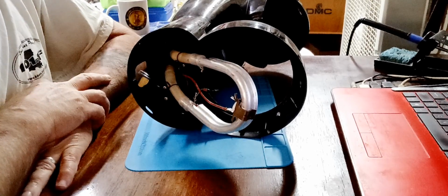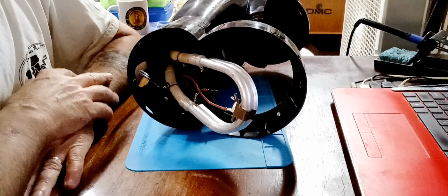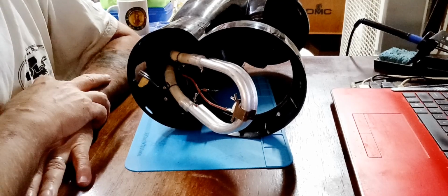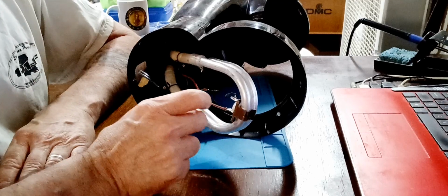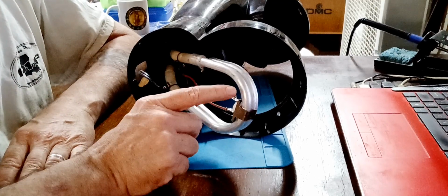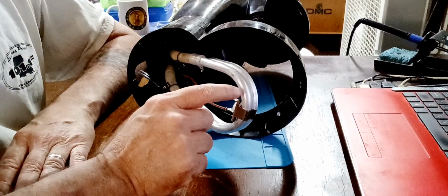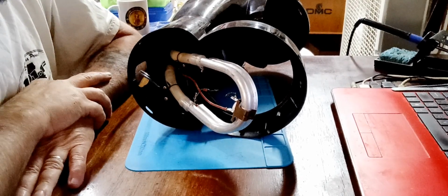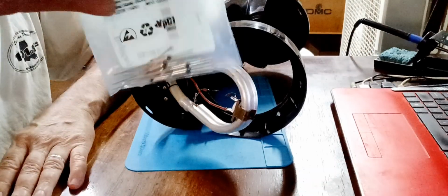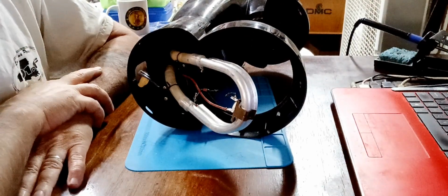A little Black & Decker coffee pot. The high thermal cutoff fuse. One of them went out. Not both of them, just one of them. They got two in series. One here, one here. I was kind of surprised that one blew, not the other. But anyhow, we got them in. Been in for a little while, just hadn't made the video yet. So, oh well. We making it now.